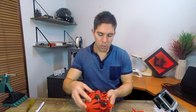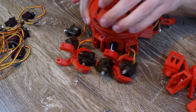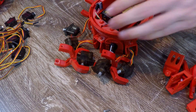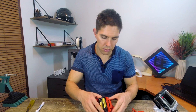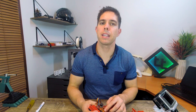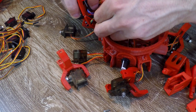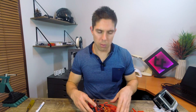Now that we've finished that, we're going to turn it over and open the lid. It's time to unplug all of the old servos. I'm going to lift up our electronics caddy — I've already removed the two screws that hold this in. In our main board where all the servos connect, it's simply a matter of unplugging the first 12 plugs — they're going to be yellow, red and brown. Let's pull them through from the outside of the robot to get them out of the way.